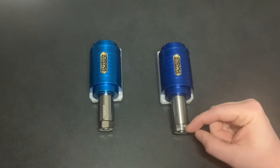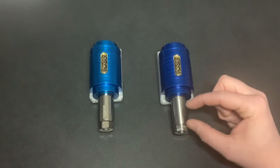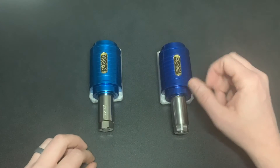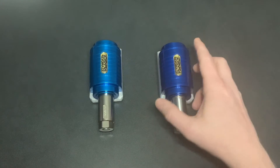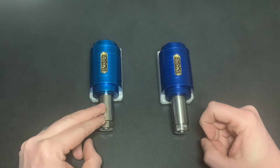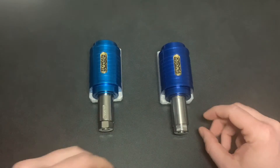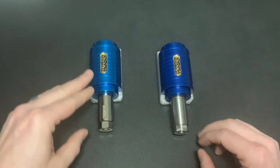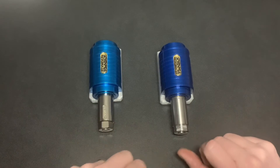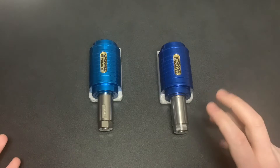It's a bit duller because it's made of different components — this is all one piece. For V3, it's a stainless steel core, but the core itself has a couple pieces where the maze is actually unplated brass. Today we'll be focusing on the V1, and there'll be a follow-up video going over the V3. The serial number on the V1 is up top, but the V3's is on the bottom. There are also slight differences in sleeve colors based on different anodizing manufacturers, small tweaks to the maze, and slightly different pin lengths throughout the years.